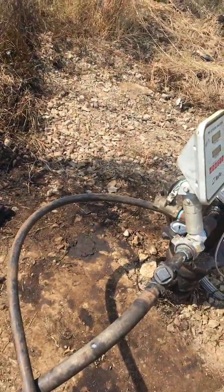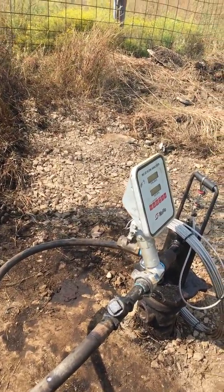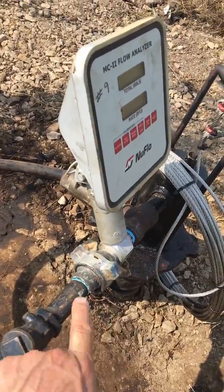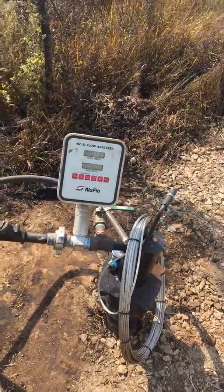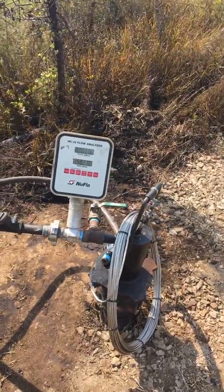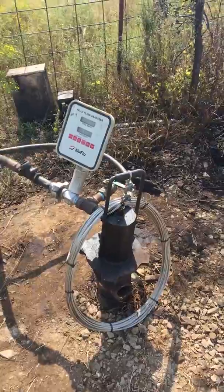There's two three-quarter lines. One is for the air in, the other one is for the air out. The one-inch line that ends up going into here — the flow line — coming out of the well is a one-inch poly pipe. Everything that we use, all the fittings, all the poly pipe, everything with the exception of the pumps, is available at a Lowe's or Home Depot store.